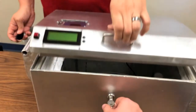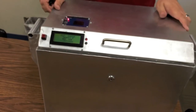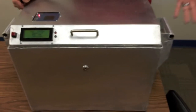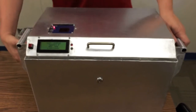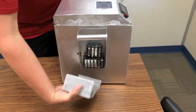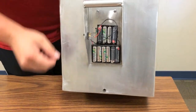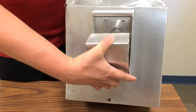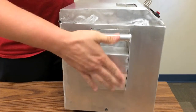Those are the main features of the impeccably smart ice chest. The box is made from 16-gauge aluminum plating, all TIG welded together, and inside is also coated with styrofoam for insulation. The handle housing is a compartment for the batteries. For this design we used AA batteries for convenience — there are other methods of power, but this is how we decided to go — and they're easily housed in the handle compartment here on the side.